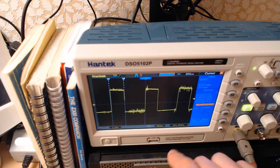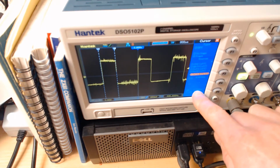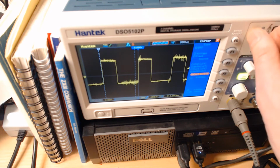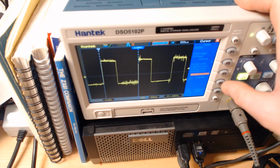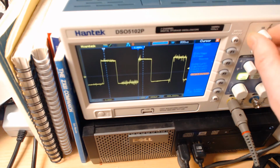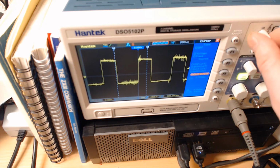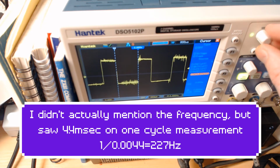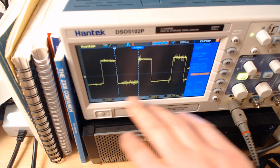So measuring between start and end, and the DT there, it's probably going to be quite difficult to see on this. Take my word for it, that says 1.78 milliseconds. So that's the period of time it's on for. We can measure the period of time. It generally looks fairly consistent, the on and off time. So whoops, just overshot there. 1.78 milliseconds it was on, and we just need to change the start. Whoops, it's moving start and end. Oh, great. Should have actually just pressed that button again. We've got to move the end back. Let's just do that. Get it on the line as close as we can. Nudge the start again back to there. So the off time is 2.66 milliseconds. So yeah, that's clearly off longer.